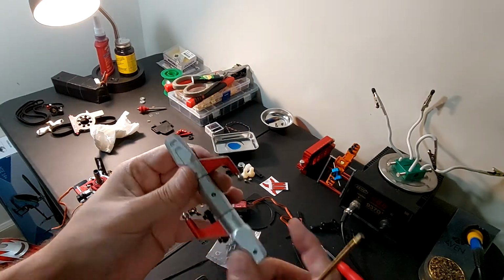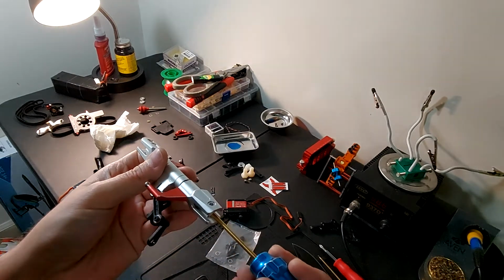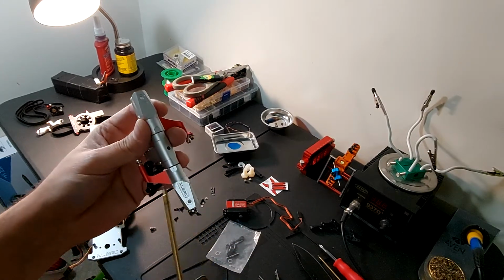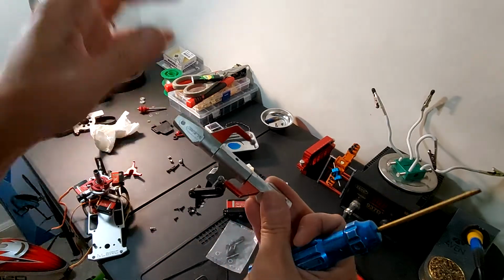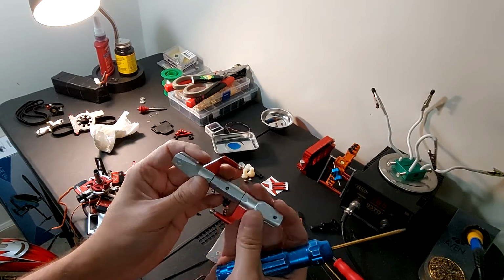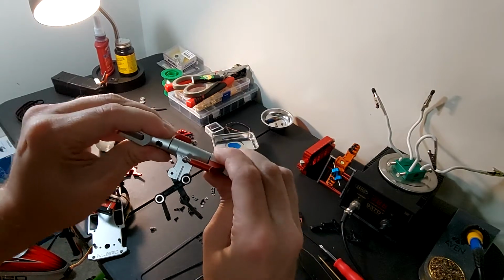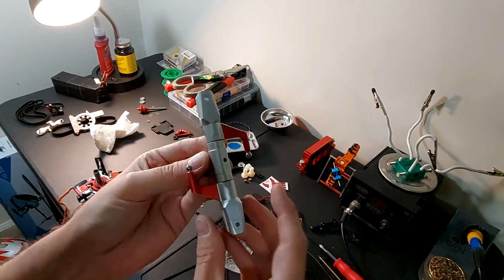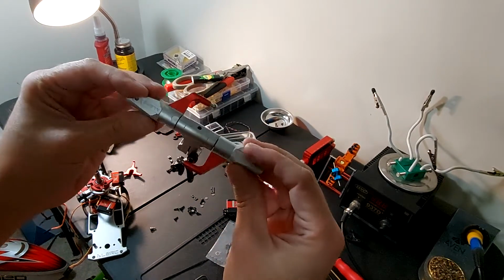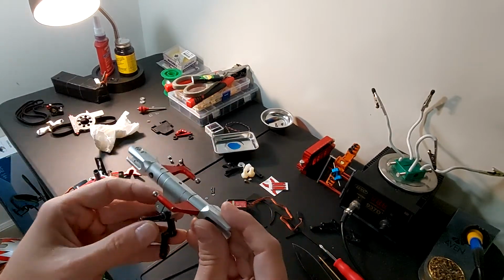Now, these particular screws have a pretty deep socket, and they're a 2.5 millimeter. These particular ones, I torque the hell out of them. So on all of my helicopters, I make sure that they are extremely tight and very well Loctited, because that's going to mess up the balance of everything. If this loosens up a little bit, you're going to have play. You know, when you put this thing together, you should have literally zero play. I mean, there's nothing. All that they can do is go up and down. There is no play, and that's how we want it.